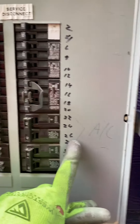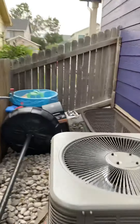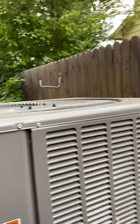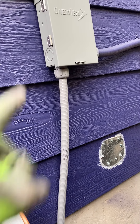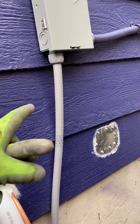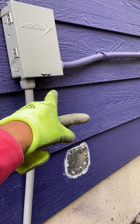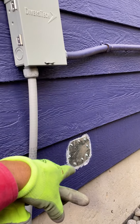They already had a 40 amp breaker in the box; this was a minimum of 34.7, so we have the minimum covered. We did add the disconnect box — even though we're close enough we didn't need it, we went ahead and added that. Covered up the old line set and filled in this area.